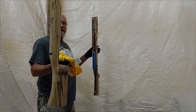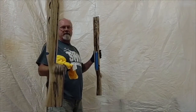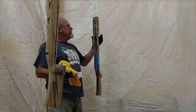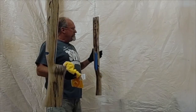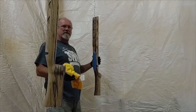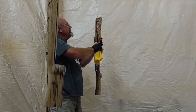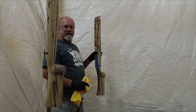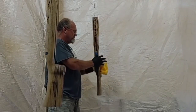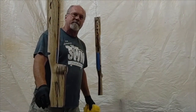Another question was about different kinds of finishes — can I go to Home Depot and get a finish that would be acceptable? Sure you can. You can spray a lacquer like DEFT, D-E-F-T, or a polyurethane on here. Most of those finishes will come out looking great, same process. They're just harder to sand — they're not designed to sand between coats, and a lot of them are not designed to buff out when you're all said and done. But if you don't have spray equipment, you can certainly get an acceptable finish by following the same procedures with a different product. So now we're going to spray the final coats on these and I'll catch you when it's time to buff them out.